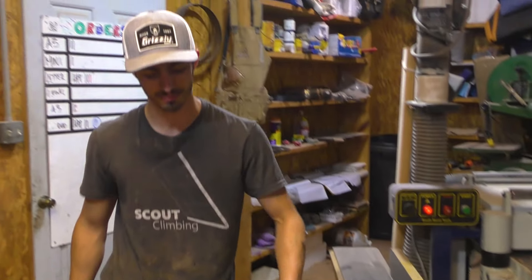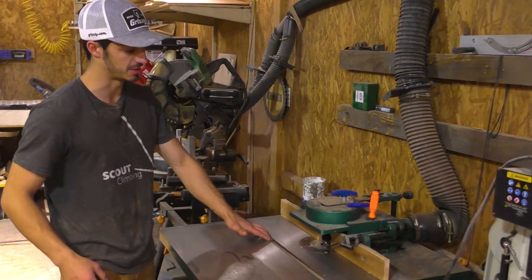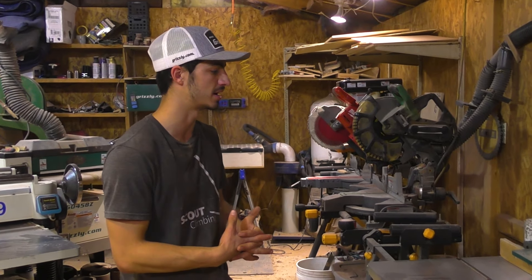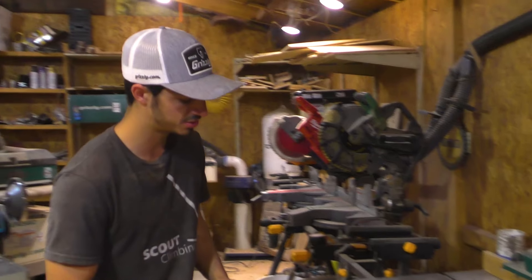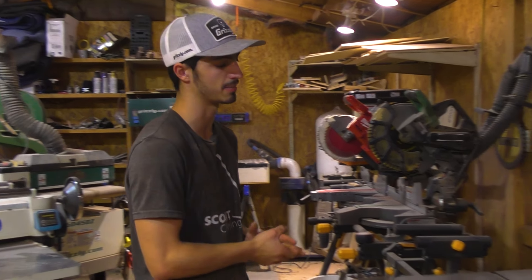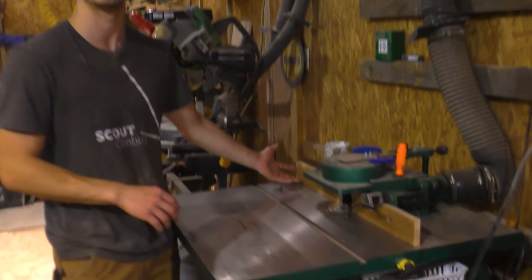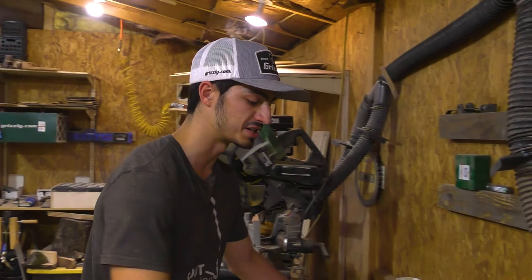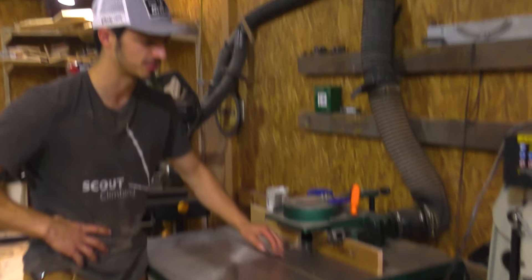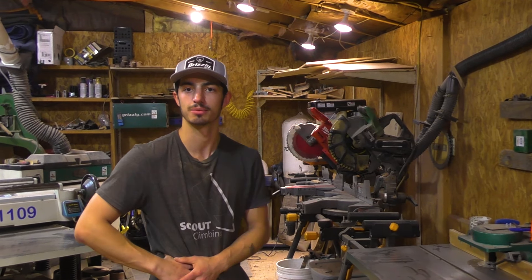The newest tool in my shop and so much fun — my shaper. I don't have a ton of cutters yet but plan to spend a pretty penny getting new ones. It runs great, it's two horsepower, the G1026 — I can't recommend it enough. The only thing I don't like is the MDF fences, which have broken and chipped fast after only a month or two. I'll cut my own at some point. Dust collection works pretty well, it has all the rings, inserts, and spindles, super easy to use.